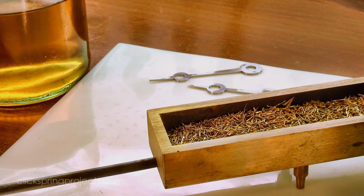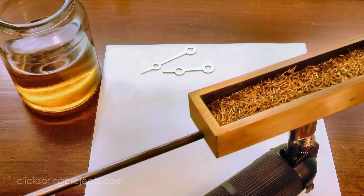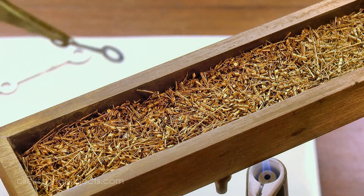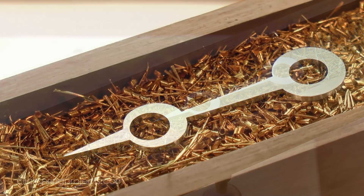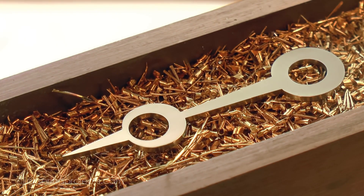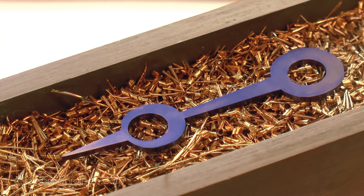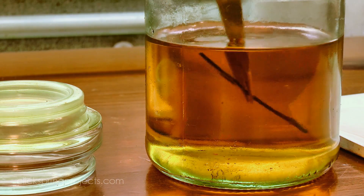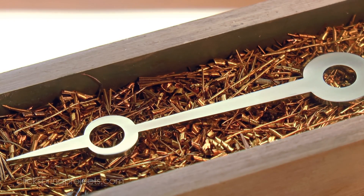The bluing tray is preheated as evenly as I can get it, and then the parts are placed into the middle of the tray one by one. This is the moment of truth, where I find out how well I've performed all of those previous steps. If the colour has any sort of flaw — for example, the very tip of this hour hand doesn't quite go fully blue — then the part must be taken back to the previous polishing stage to remove the oxide, re-clean, and then have another try until it's right. The colour I'm aiming for is that rich deep blue with just the barest hint of purple. But even with all of this effort, that colour can shoot by before you know it, and again if that happens, it's back to the polishing stage for another try.